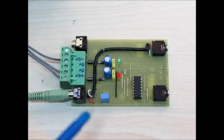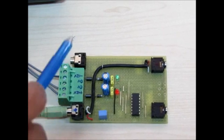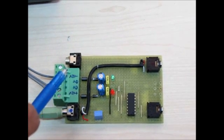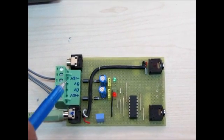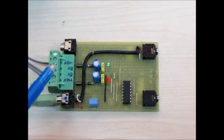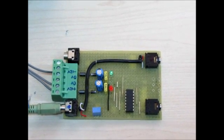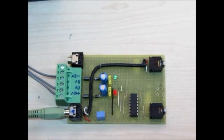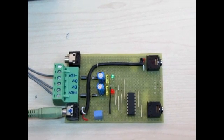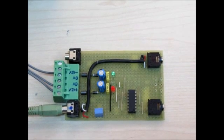Here is the second part of our circuitry, which is the driver board for the tactile actuator. This board is a low-pass filter for filtering in the locomotive vibrations and low-frequency sounds felt inside the locomotive by the driver during usual operations. We feed the output signals from the board to an actuator through a power amplifier, transmitting these vibrations into the mountings of the driver's seat. We hope that this will bring more realism to our project.